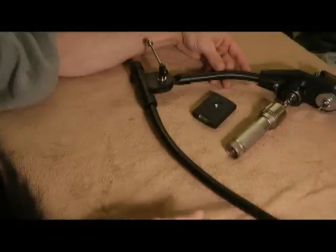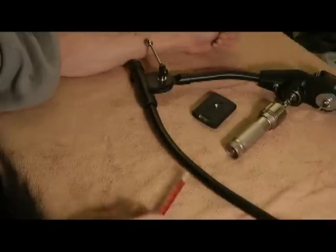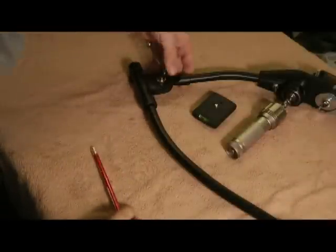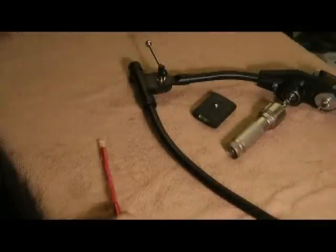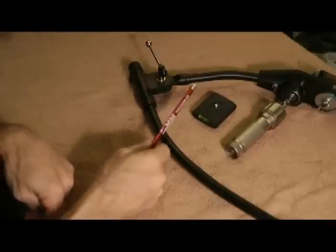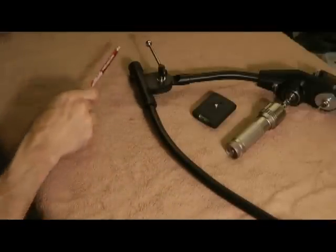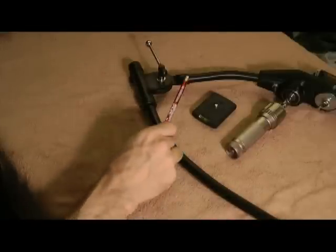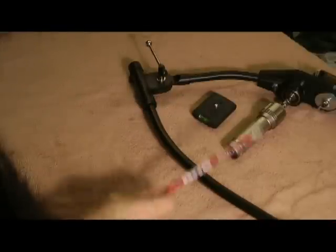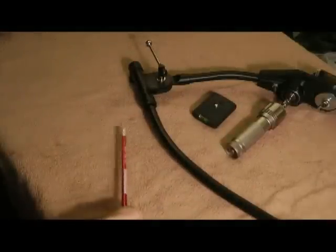What the arc length does for you is: the shorter the arc length, the less bottom heavy it is; the larger the arc length, the more bottom heavy it will become. Having this joint here to adjust my arm arc distance I thought was very important. I was going to make a plastic piece with some teeth in it and clamp it down to adjust it that way. Then I came home one day, saw a boom mic stand sitting in the corner of my living room, and realized the joint for the boom mic stand was perfect. This is the actual part that holds the mic, this is the tail end of it, and this is the part that runs down to the tripod stand. So I sacrificed the boom mic stand to make this — I just cut the arms, put them in a bender, and there you go. I've got the arms I needed.